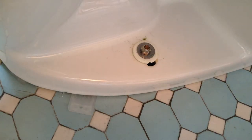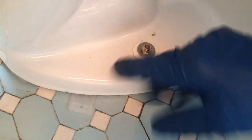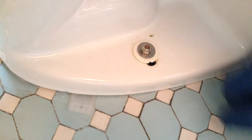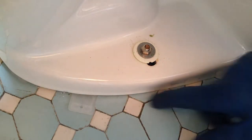Don't over-tighten them. In between the closet flange and the toilet bowl is a wax ring. When you've shimmed it up and put it back down, you want to make sure you haven't broken that seal. So flush the toilet and look around to see if you see any water coming out anywhere.